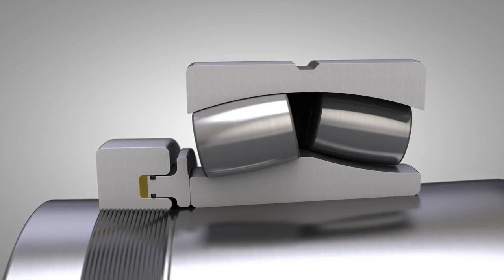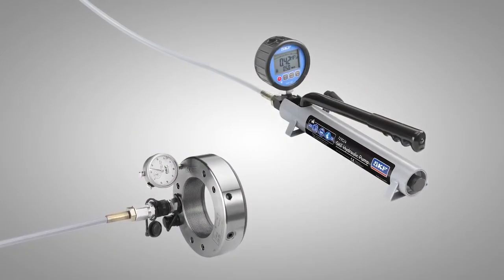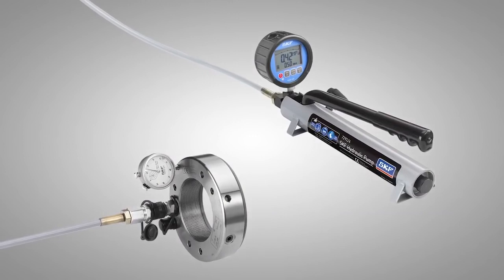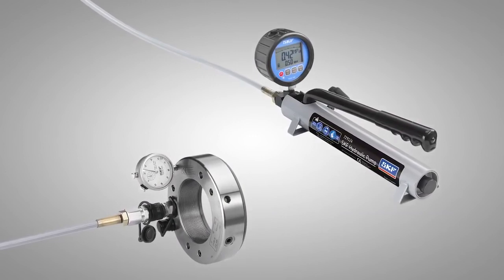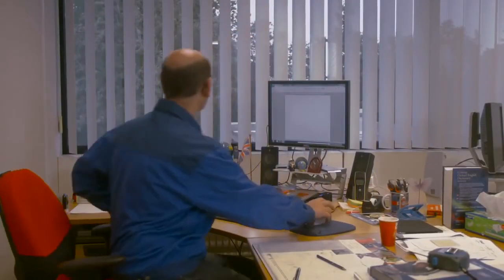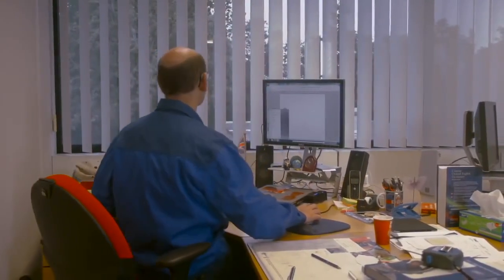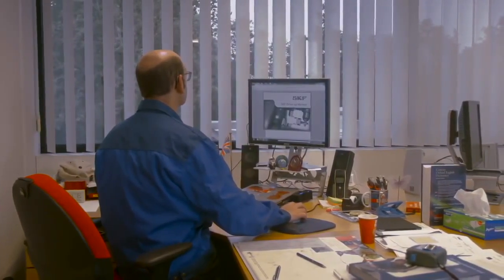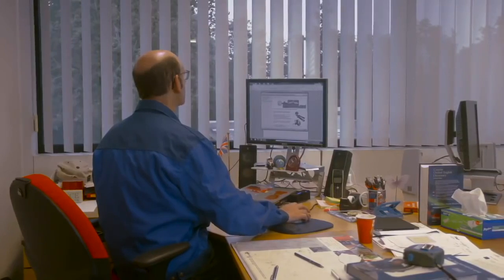axial drive-up distance. To perform the method, you need a pump with a digital pressure gauge, an SKF HMV hydraulic nut and dial indicator. The methods required to mount the bearing can be found at skf.com/mount or by using the SKF Drive-up method program available free from skf.com.